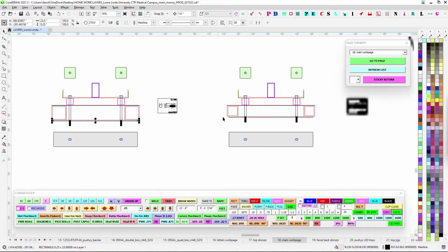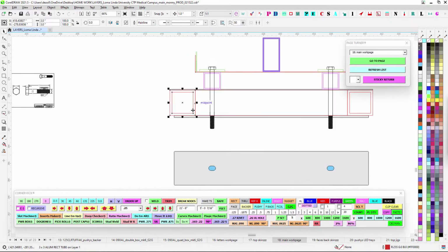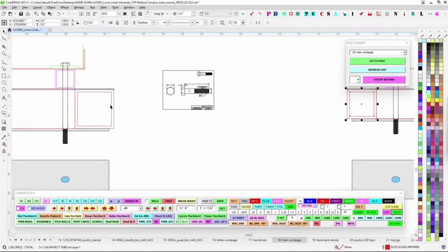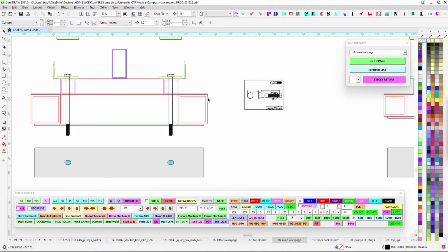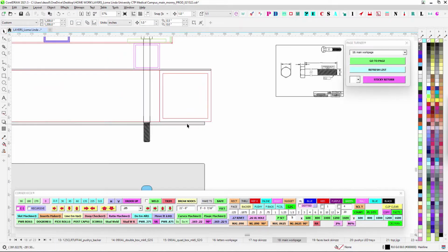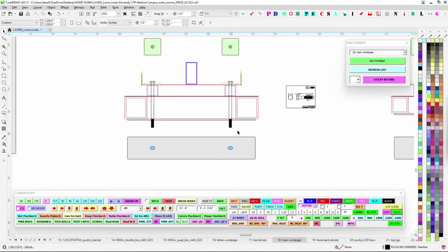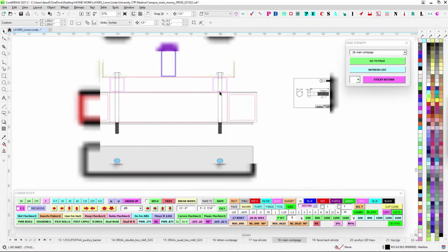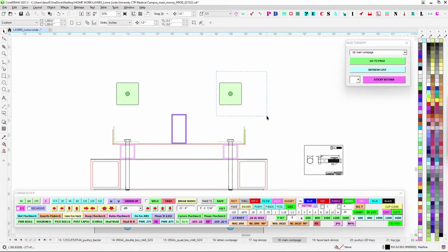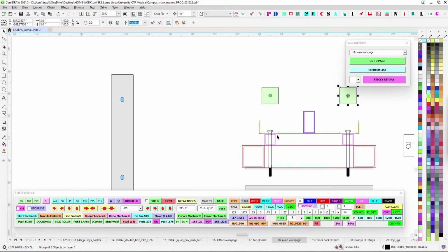to the existing base. I brought in 7-inch bolts as well, just in case this thing's made out of 3x3. Since we didn't have any hard measurements, but also if the sign is 26 inches wide, you still have enough to grab. So this should work for all sorts of things happening. Just bring these bolts with you. You're going to need 1/2-inch hardware, bring all that. But like I said, I got these 3-inch washers ready to go, so you can use those.